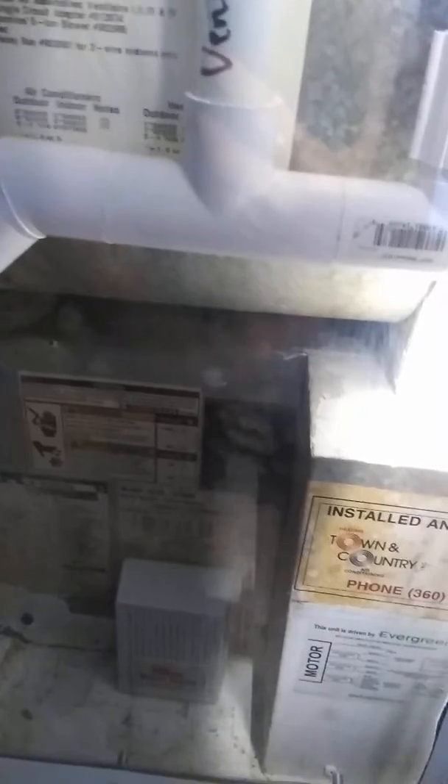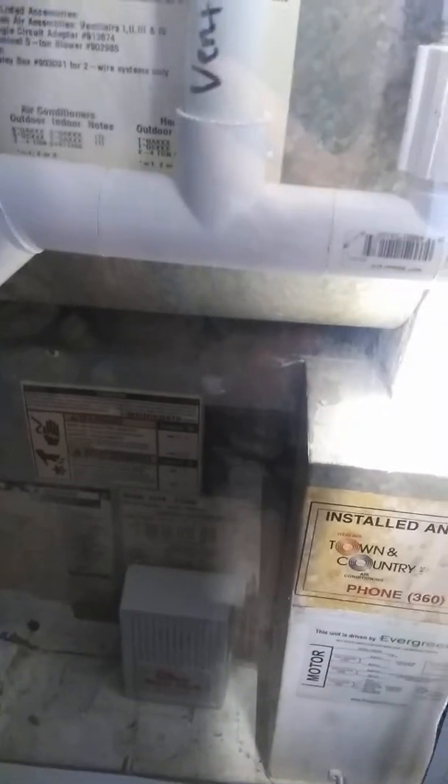Vast improvement. So this is an issue that I'm pretty sure a few people are aware of because there's a kit that's made. I had to do a lot of digging to find this kit, but there's a kit that is made to seal the condensation pan down on the furnace body. And it seals up the copper tubing up in here so that it doesn't sweat so much. There is a kit that's made, but let me show you what I did here.